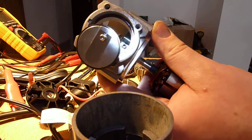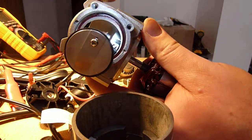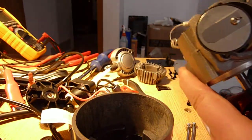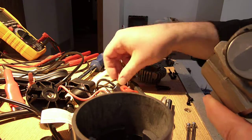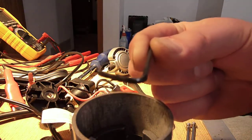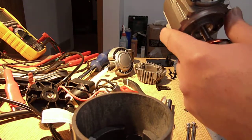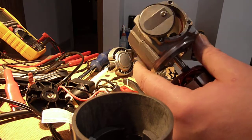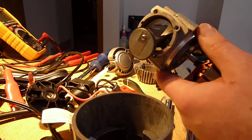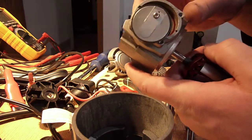There is the screw to take out to pull the flywheel off. Can you see the twists on there? I cranked on that bugger — it twisted my allen key. So whatever is holding that in there is really tight, and it's got probably red thread locker on it. I cannot get that screw out to take the flywheel off.